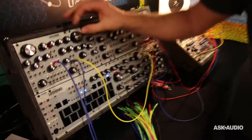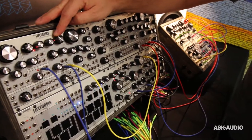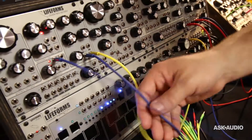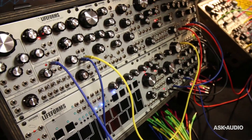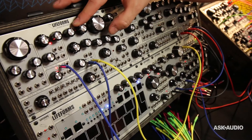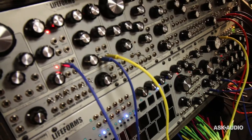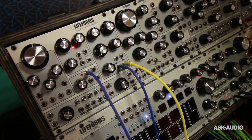I'm just going to patch in a little patch here. What we're listening to is the oscillator, a sine wave, going through our wave folder, and then through our low pass gate that we're plucking with a little square wave. Right now this is the short pluck. We can open it up, and you can hear how it sounds like you're hitting a woodblock — it sounds so organic, so natural. That's the magic of the low pass gate circuit. But because we're not using a Vactrol, we can dial in exactly how much of that we want, and use it almost like a synth voice on its own.